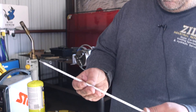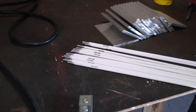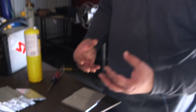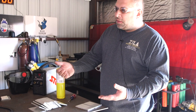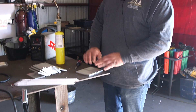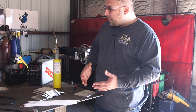Once you have these rods out of the package, you kind of want to use them — they draw moisture and you don't really want to put them back. If you put them in an oven they get brittle and the powder just falls off. Aluminum rods burn a lot quicker than something like a 7018. The slag is kind of a milky deal, and really the key is pre-heat — consistent pre-heat would be ideal. After the weld cools down fully, the slag should release very easily just by scraping it — no need to hammer on it. Whatever slag you can't release by scraping, take a rag with warm water and just wash it off. It literally washes off with hot water.